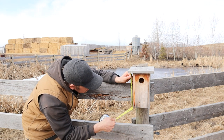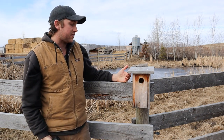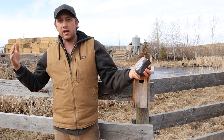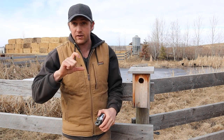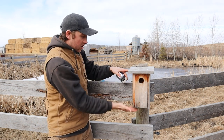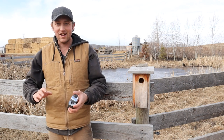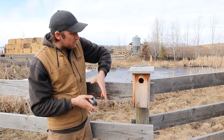For the side pieces, I'd make them about ten-and-a-half to eleven inches. Eleven inches works well because your saw blade takes about an eighth of an inch, and if you're buying eight-foot lengths cutting at eleven inches means you'll get all full pieces — at twelve inches you'd end up with a short piece at the end. So make the sides less than eleven inches tall, cut two for each birdhouse. Set your board stop at eleven inches and cut them all out — identical, no measuring needed.